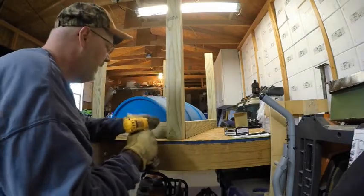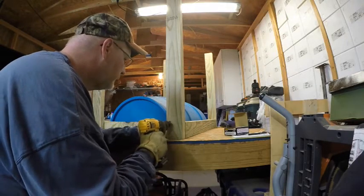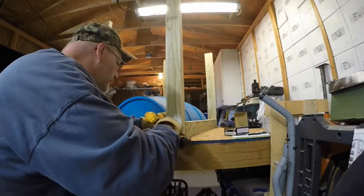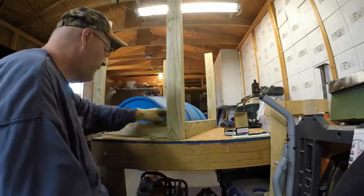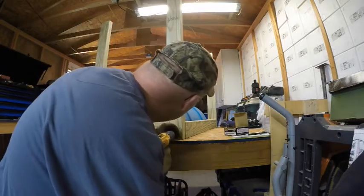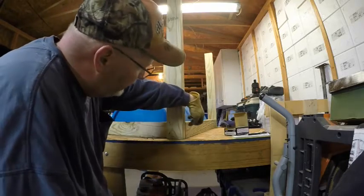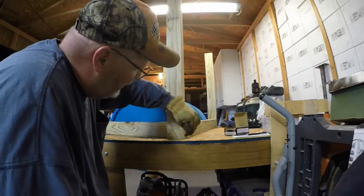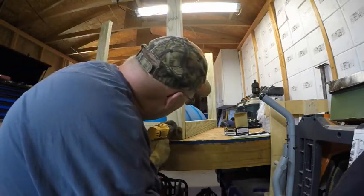This piece of wood is dry. That went right through a knot. I kind of felt that pull over a little bit. Now what I'm looking for here is where I put my screws in on this sideboard. I'm running these screws in between them, making sure that I'm not going to hit them or blow the wood out or anything.